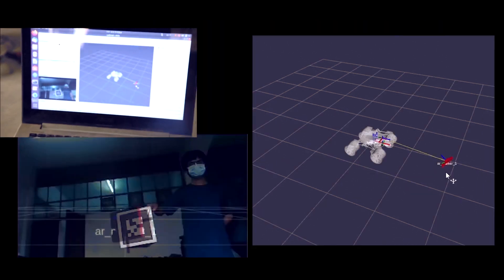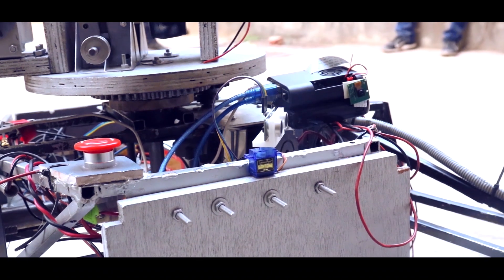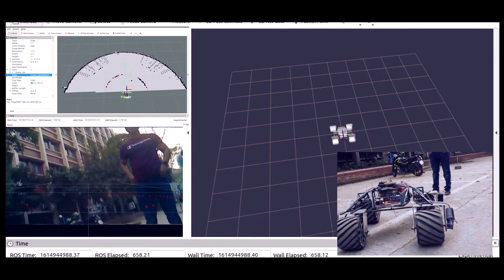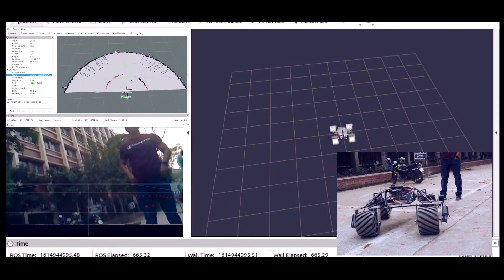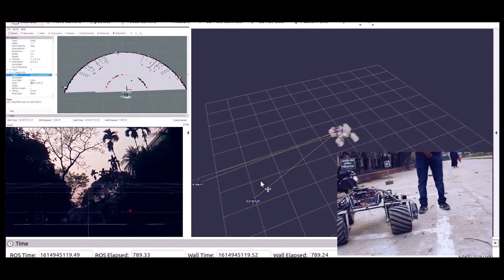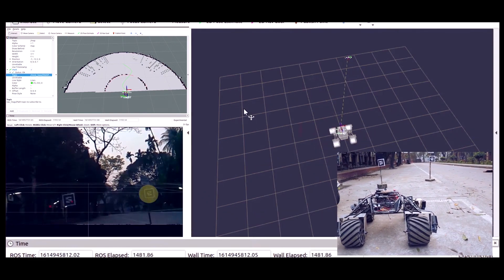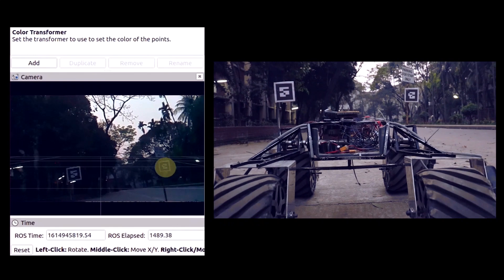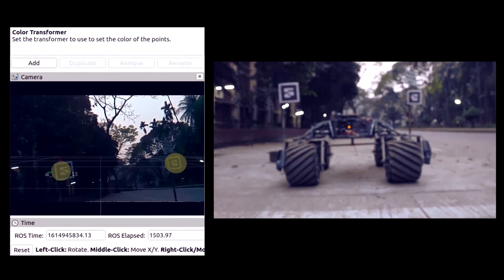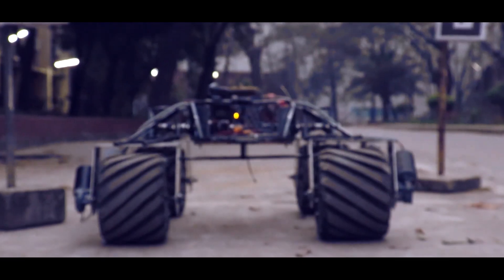It can also track the ArUco tags. The Rover uses scans from ultrasonic sensors to detect obstacles. Scanned obstacle data is plotted into the Rover's coordinate system, which can be seen on the camera feed and RViz display as red dots. From the scan data, it creates a map using SLAM gmapping, and then a dynamic window approach path planner creates a path avoiding obstacles. After reaching the target coordinate, it searches for ArUco tags and can detect multiple tags together, giving their position and orientation. Using this pose data, the Rover drives through two poles autonomously.